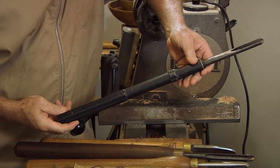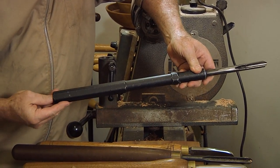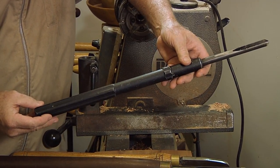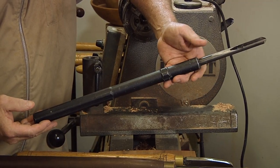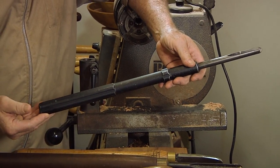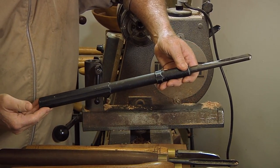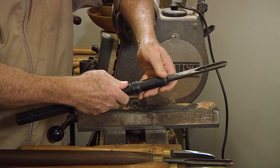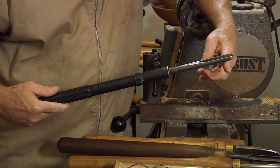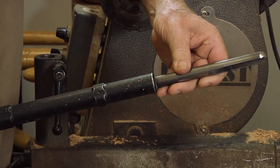This is another handle — this one is filled with lead shot. I believe the material is aluminum. The lead shot seems to be the new popular thing nowadays. Everybody at the last AAW symposium making modular tool handles had a little screw-off cap on the end so you could fill it with lead shot. The idea is it makes it more weighty and absorbs vibration. I don't particularly care for them — I'm generally grabbing higher on the gouge, so that's already a counterweight. The closer you are to the wood on the tool rest, the less vibration you're going to get out on the handle end. But some people really like them.